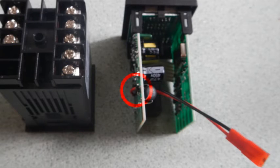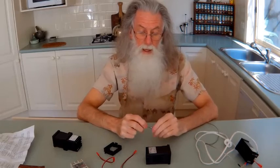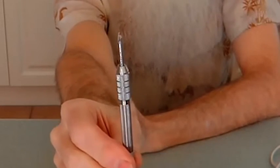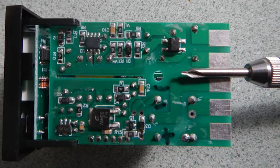The only reason to drill a hole is to allow the cable to come out. Don't use a pistol drill — don't waste your time, it will slip and damage something. Buy yourself a little pin vice; these have a little chuck on them, and if you do any little circuit work you can put a little drill in there and drill by hand. I've got a number one center drill — center drills are great because they have a very small point but won't snap on you like a regular drill bit of that size would. On the circuit board, get a sharp pin and mark the position of the hole. I put mine above the relay terminals, halfway between any other contacts.